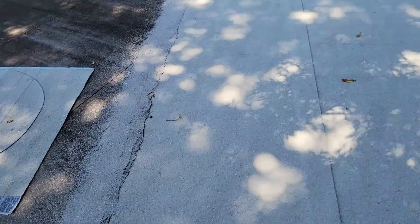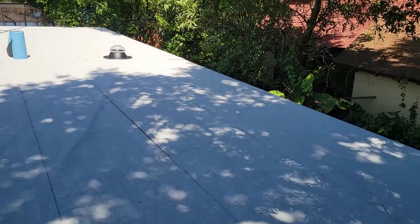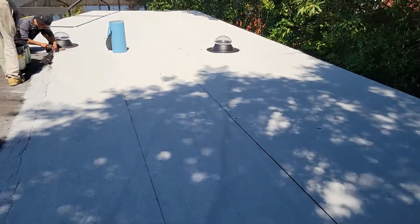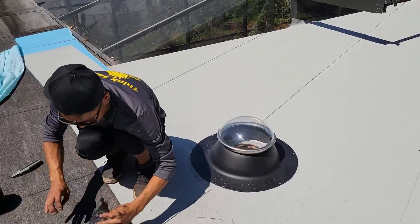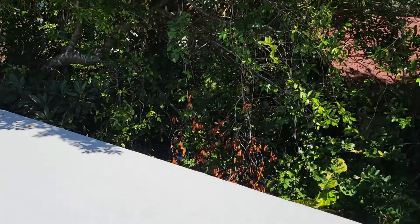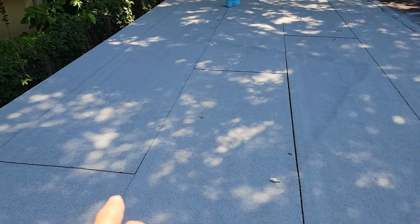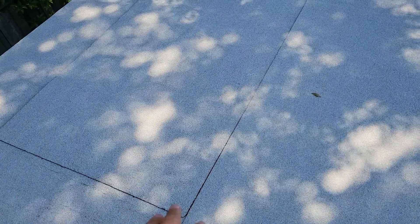Getting close to the end here. They're doing the embedding, we'll come back and touch that up — it's looking pretty good. We've got a strip, got to put the targets on. Up here at the top, we're actually just going to go ahead and run a half, an extra half sheet, and run that half all the way up to the ridge just to re-secure that edge. You can see your laps here — I stay six feet apart, three feet is minimum, but I stay six feet.